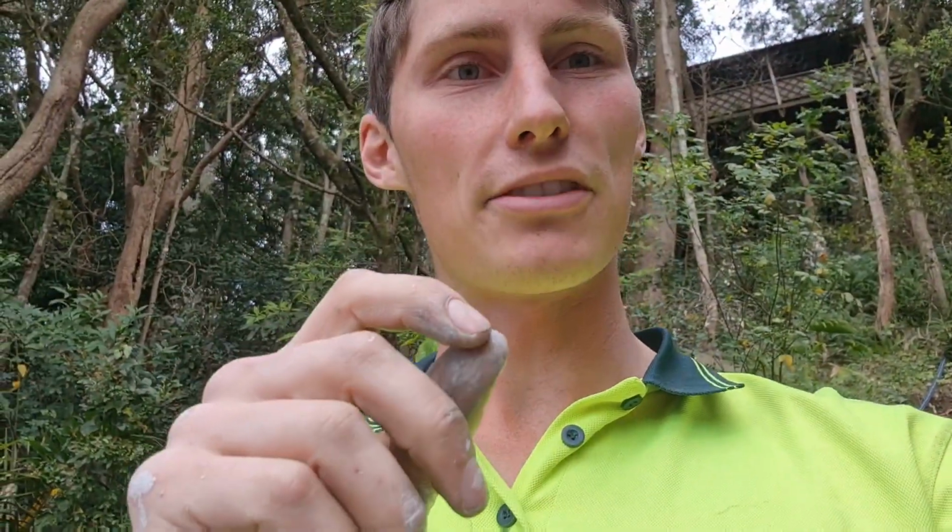product, because the engineer specifies that you have to have a core flute, like a black plastic, that lines the wall to make sure that when you backfill, the backfill doesn't put holes in your waterproofing. But this product is a roll of stuff. It's pretty expensive, but it itself is actually waterproof, and it has a geofabric on it as well. So I'm not sure what the geofabric's on there for, but apparently it's good. I recognize there's a problem with it, that it's not going to actually create a place for water to be stopped at the very bottom. Like, water can still pool at the bottom of it, but if there's a pinhole higher up, I can tell that it'll protect it, and it's cheap insurance.